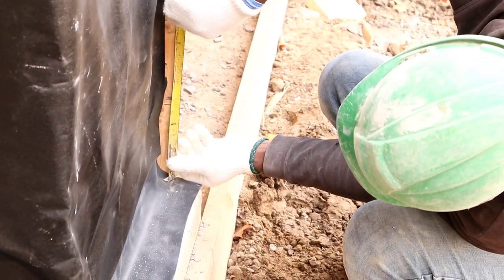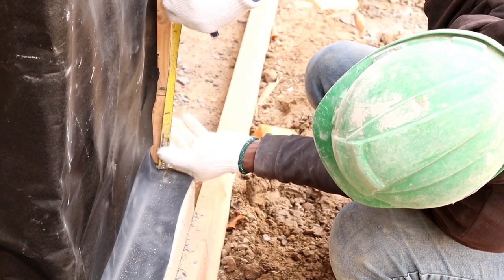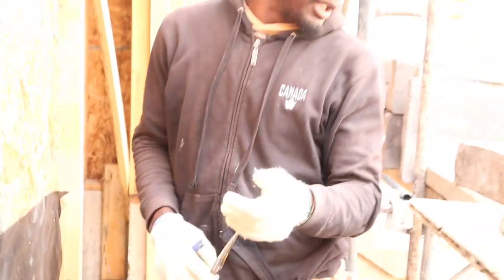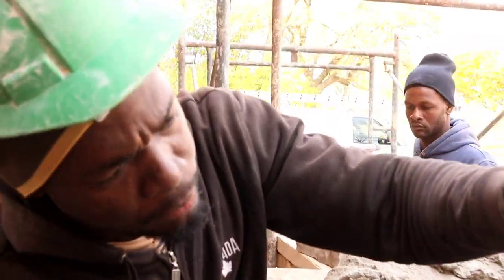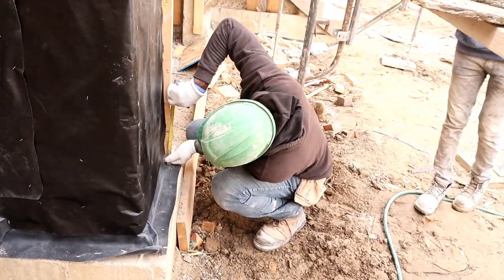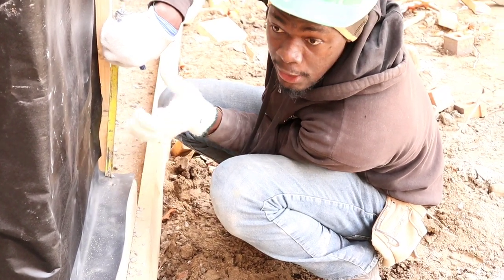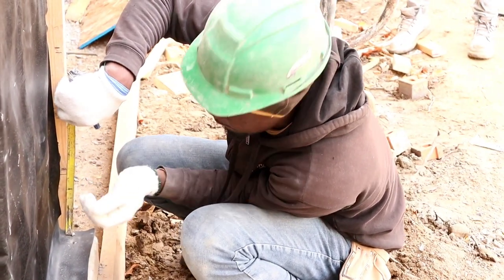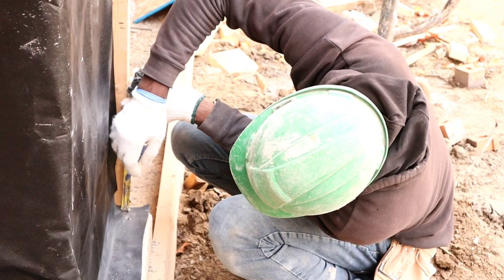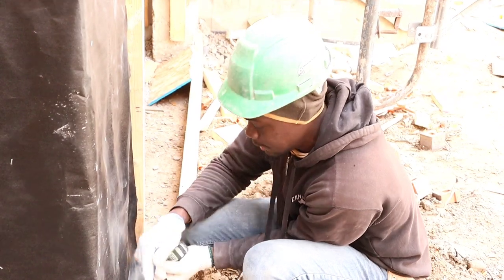So here, this is 6 1/4. So right now it's telling me that I have to cut in order to get up there. Or I have, so I'm gonna measure the size of my medium stone. My medium stone is 7 inches. So here is 7 inches. If I had to go 7 inches, I can get up there, but we have to work with a tighter joint than half an inch. Okay, 7 inches is where the joint is called, as you see right here. So we could get away with this. All we have to do is go tighter than half an inch. Still will look nice. So here we're perfect.